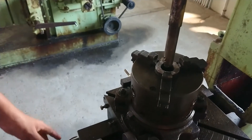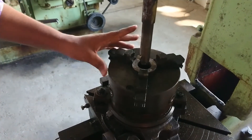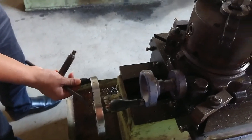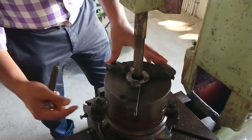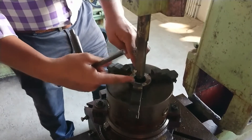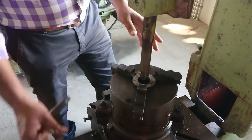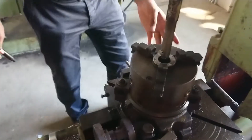Once you tighten the job, there is a wheel used for moving the chuck to the front and back side. If you rotate one way, it moves forward; the other way, it comes back. Also, there is another option: if you want to put more than one keyway, you can rotate the chuck using this handle — it acts like an indexing head mechanism.